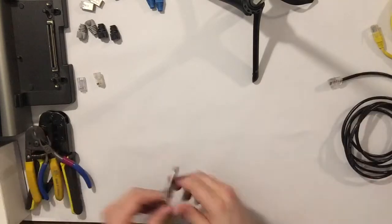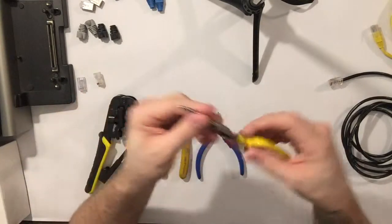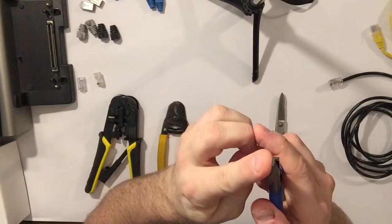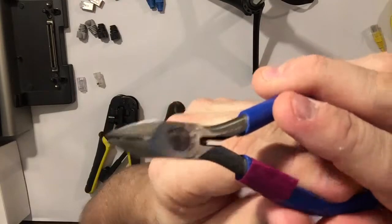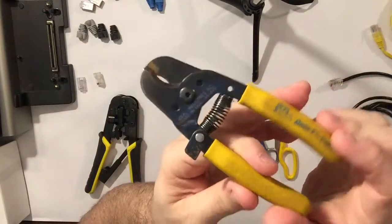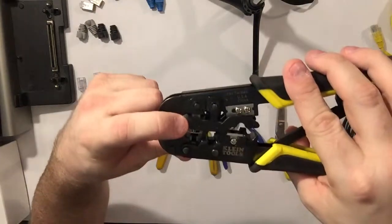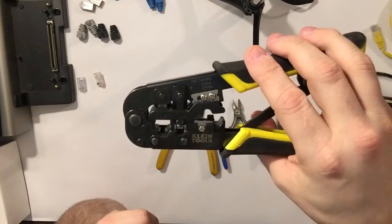A little look at the tools and what we've got here. You don't necessarily need all of this, but I just want to show you some different options. These are electrician shears — I like these a lot. Just some flush cuts, angled off and completely flush with no bevel on this side, so when they cut it'll be flat exactly where I want it. This rounded-off tool is good for cutting bulk cable, but also good for stripping insulation. And these are the crimpers we'll use on the RJ45 connector — this has an 8-pin and a 4-pin, so you could use it for a telephone connector as well.